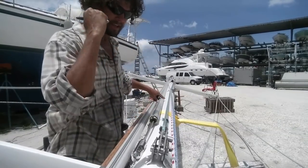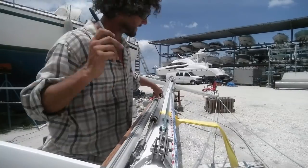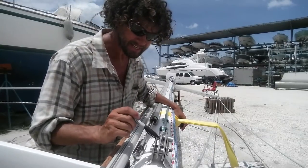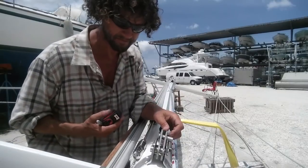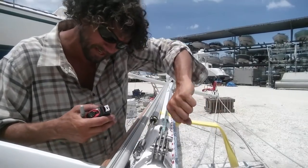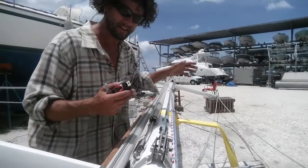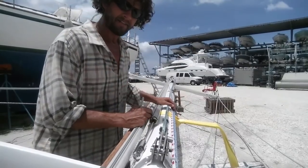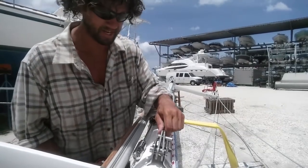The length from here is 33 feet — let's say 32 feet. How many four feet go into 32 feet? Eight times. So in theory there's going to be eight times 19 inches — that's where the stay is going to land at minimum. So eight times 19 — that's about one and a half feet, eight times one and a half is 12 feet. I've only got 12 feet and because this is 19 inches I know it's not going to fit. I'm going to have to cut away that a bit more and make sure this pin doesn't touch as it goes down lower — because I don't know much about rigging and if something is not in line that's putting a force on this pin. If that cotter pin is right on the edge it could snap off, the pin falls out and then we're in real trouble.